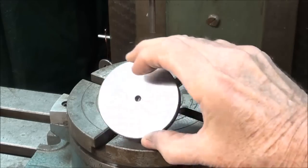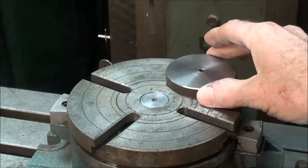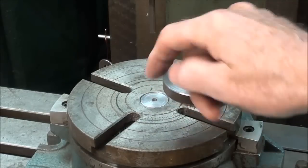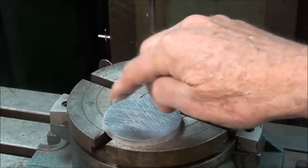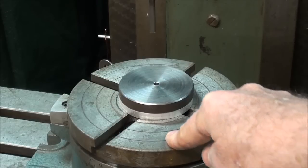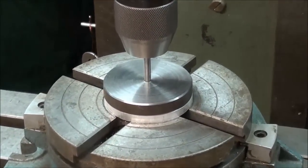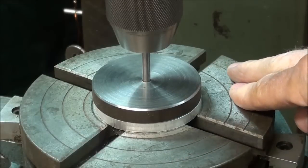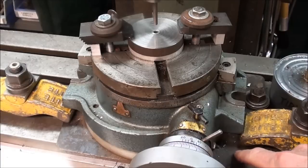Next, we need to locate our work. This is the 2-1/2-inch steel that we're going to drill a bolt circle in. It needs to be located in the center of the table, corresponding to the center of this hole — everything needs to be concentric. I don't want to drill into the table and ruin it, so I've prepared a small piece of aluminum packing that's just a little less than 2-1/2 inches, and that'll go underneath so I can drill into the aluminum — sacrificial, if you will. Using a 3/16ths rod in my Albrecht chuck, I have centered the work on the table and now I'm ready to clamp it.